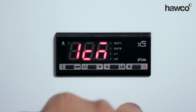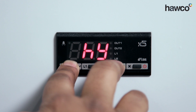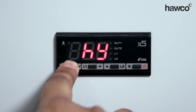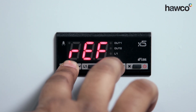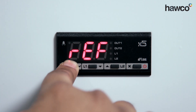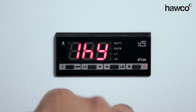Now 1CM. This is where we choose our hysteresis or proportional distribution band. I always like to use hysteresis because we're talking about a physical temperature difference every time to make the compressor or the heater cut in. The next one is 1CH — this is very important because this is where we choose whether it's going to be a refrigerator or used for heating. For relay one, we're going to use it for refrigeration.